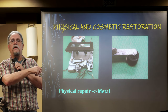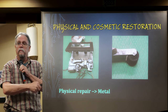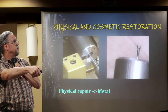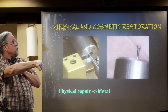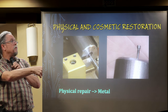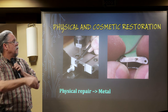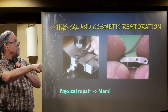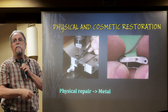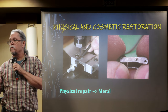This is a micro cassette deck from an Epson HX-20 — the same deck used in thousands of answering machines. A small metal nub broke off. My repair: I drilled a hole in an arbor, threaded in a 2-56 screw a couple of millimeters, turned down the shaft to the size needed, then drilled and tapped a hole in the arm, threaded the screw in, and cut it off — now there's a nub. Sometimes you have to work in a seemingly strange, roundabout method to fix things.